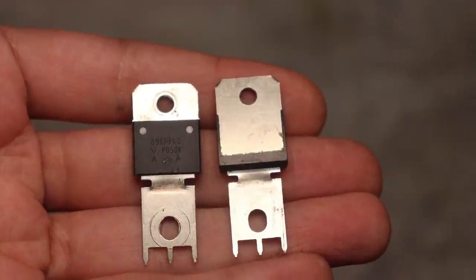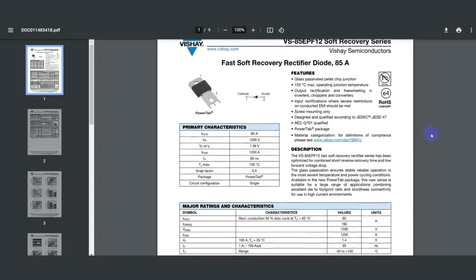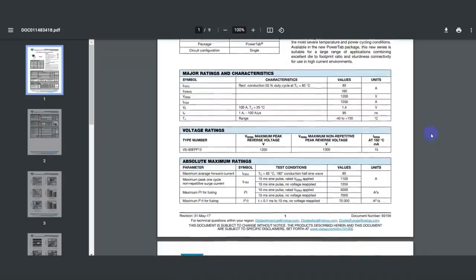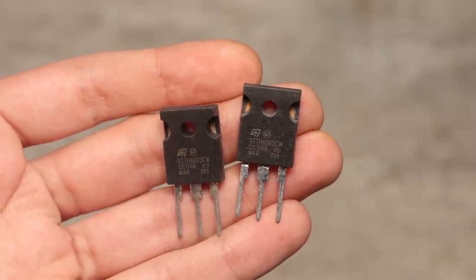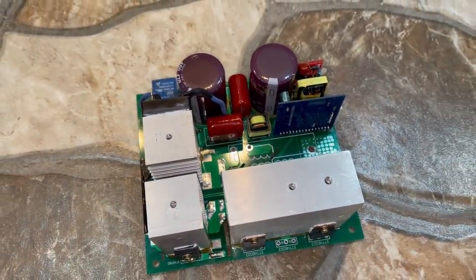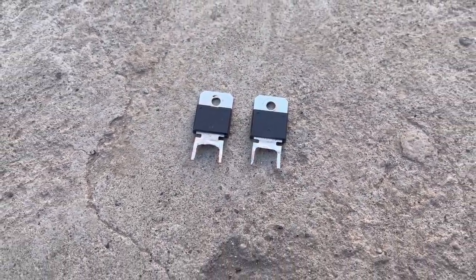VS85EPF12. Once a kind subscriber sent me a bunch of such diodes, and since there are a lot of them, why not use them here? These are single fast diodes for 85 amps and with reverse voltage as much as 1200 volts from the eminent Vishay. At the same time, they have a drop at a current of 85 amps of about 1.36 volts. When compared with STTH6003, then at the same currents on the finished rectifier, with STTH we will have more heat losses than using these Vishay diodes. That is, the latter are much better. So I decided to set them.